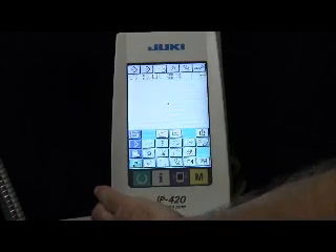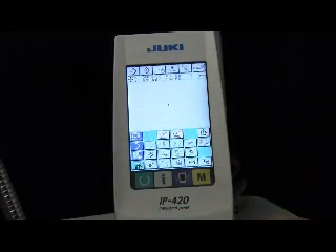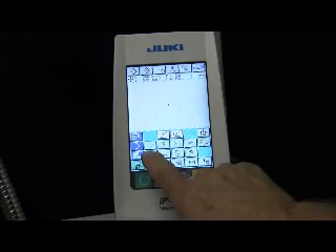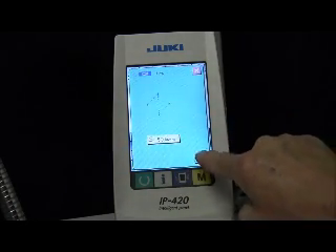This is just a quick start to get you to draw a basic program. First thing you want to notice is the 000 — there are your coordinates, you're at the zero point. You need to jump to a location point, so push this key here, which is jump, and accept the jump speed.